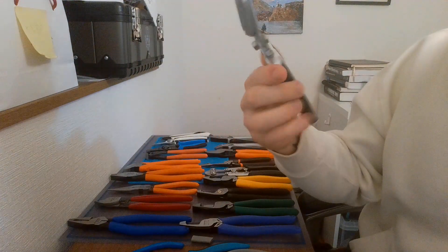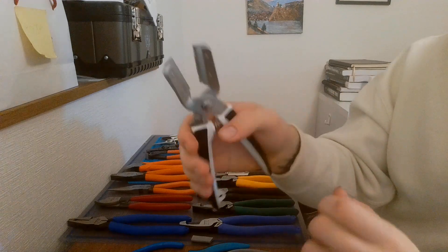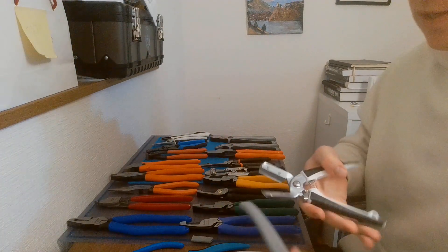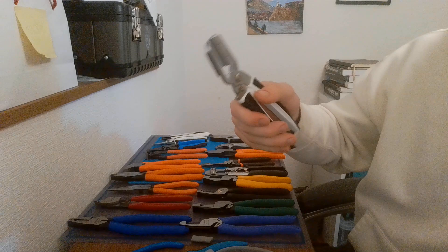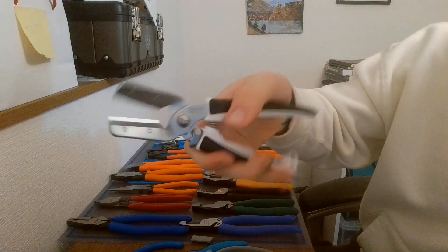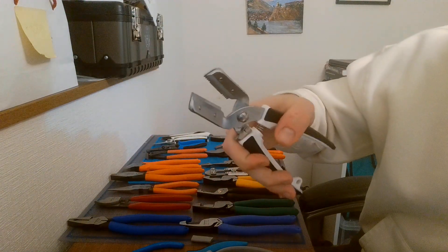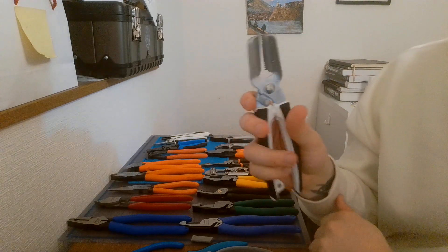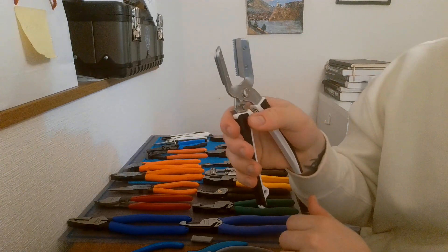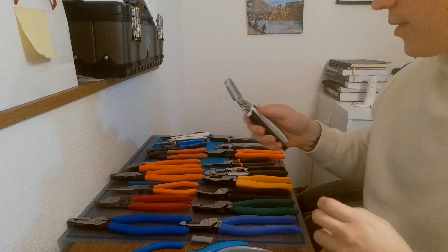These are the Tajima DK-MC40s — these are specifically for scoring cable so you can shear around it and pull off. On Romex you can do it if you want, but you don't go all the way. These are very sharp by the way, and as long as you get the depth right and move around without going further in, there'll be no trouble. But it's so sharp that if your hand wiggles even just a little bit you'll cut right through the jacket and into the copper.